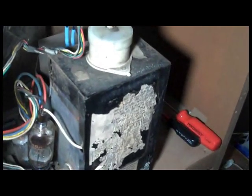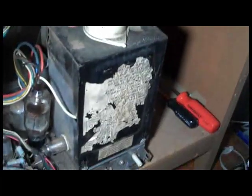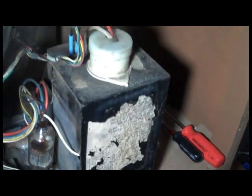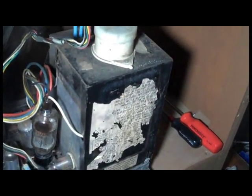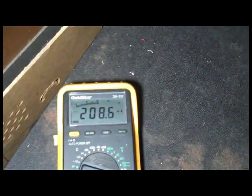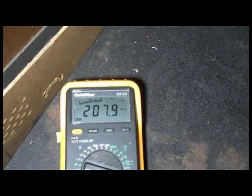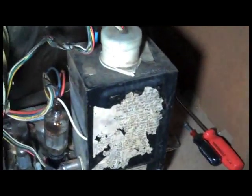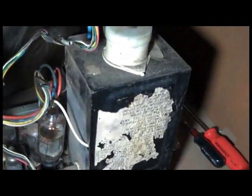Day two — finished and working. The flyback had to be removed again and the core replaced. The core from the old RCA factory flyback was removed and installed into the Packard Bell replacement flyback. A grayscale setup was also required. Now running about 207-208 milliamps cathode current, and the manual specifies 210 as ideal, so we're just under that — looking good.